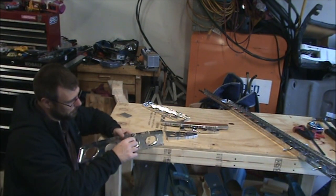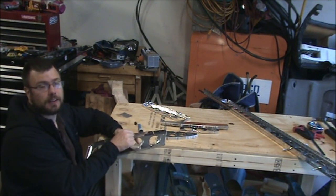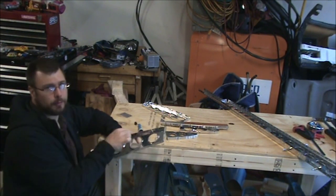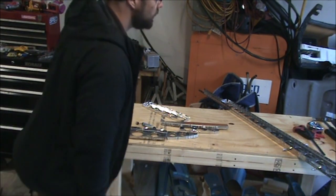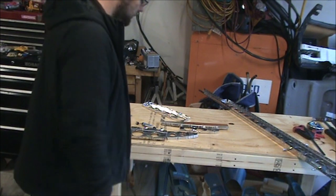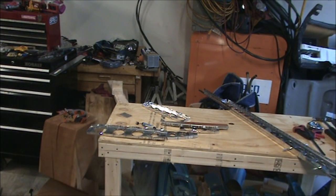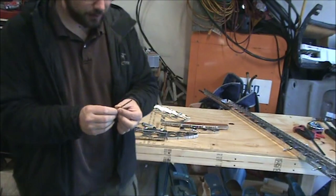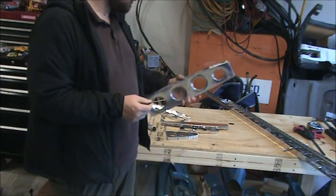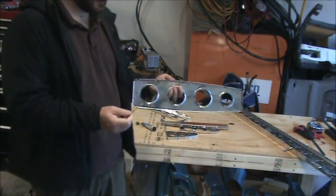This deburring tool obviously won't work in there, so it's a good time to break out that large drill bit tray. And I specifically set my drill bit aside somewhere. It just has to be larger than the hole that you're doing. So those are drilled out to be number 40 to match up with the 3/32 rivets. So a 3/16 drill bit is a good one that'll have lots of clearance to fit in there, and you just spin it around once or twice.